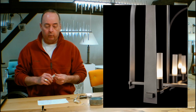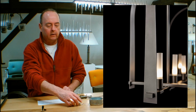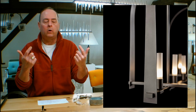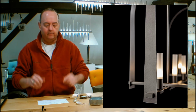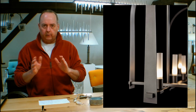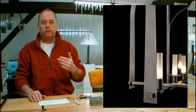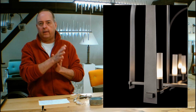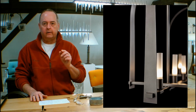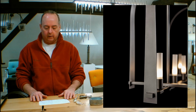In the middle, what we like to use in our showroom is called warm white. And warm white is the color of the light coming down on this table right now. That's coming down from the lights above. These are warm white 3,000 Kelvin LEDs. So you'll see that's going to be offered as well. So it doesn't matter what you get. You just want to kind of zero in on what you guys are looking for. It's a dimmable fixture. Make sure that if you're doing halogens, you're going to buy a dimmer for that, because it's going to be a little different than the dimmers that are offered for LEDs. Tell your installer that you're using LEDs in it so they use the correct dimmer on the wall.